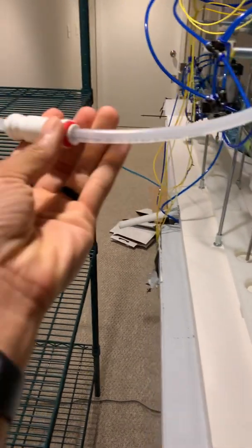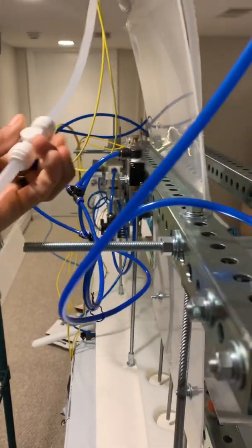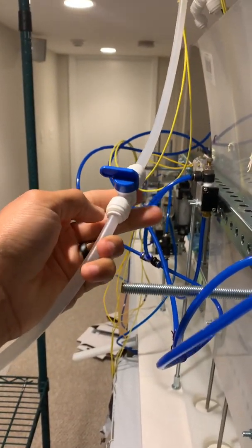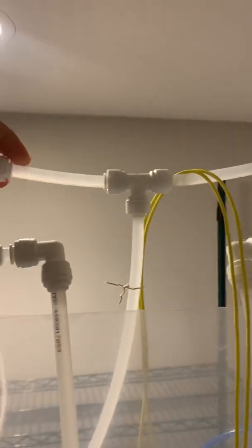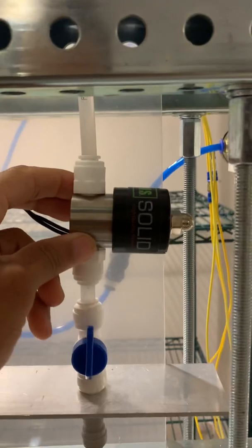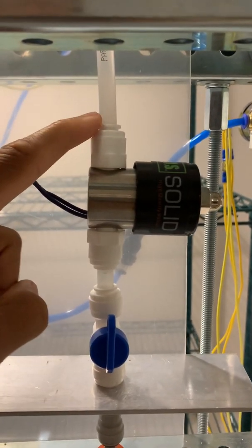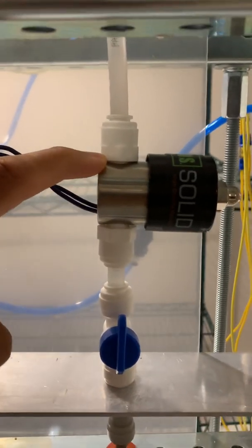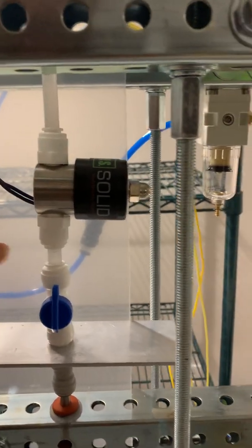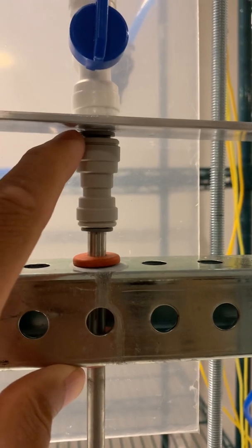Back here I've got a one-way valve from McMaster. All these lines are 3/8-inch outer diameter and they're all quick-connect. I have another ball valve here just to turn it on and off before the line — if something happens I can shut it off there. The lines go into a T, with 3/8-inch quick connects, an elbow, a T, an elbow, and the same thing repeats on this side. This comes down to another quick connect, and these solenoids need to be cleaned occasionally because stuff will gum up in there.